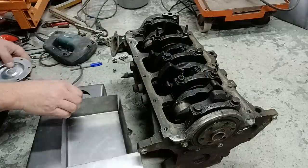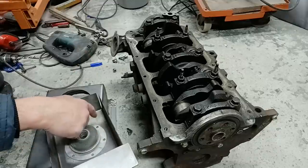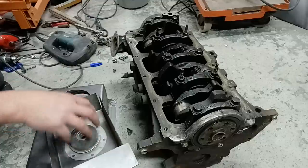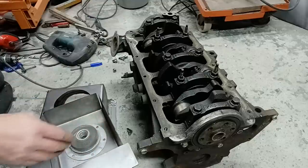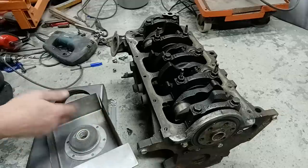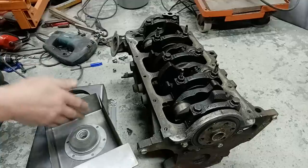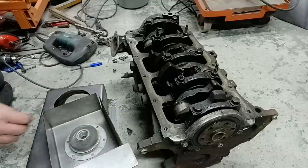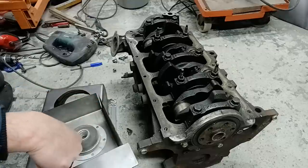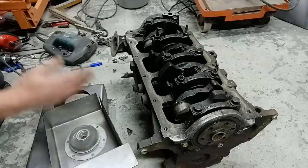And when it's in the center there somewhere, we'll put a wall around it as well, so it'll catch the oil slop. I'm not overly worried about making it super baffled with baffle flaps and what have you, which you have for race cars, but for a road car, simple baffles will be more than enough, even if it's just straight lines there and there, with enough holes for the oil to get backwards and forwards, just to stop that sloshing about when you're cornering.